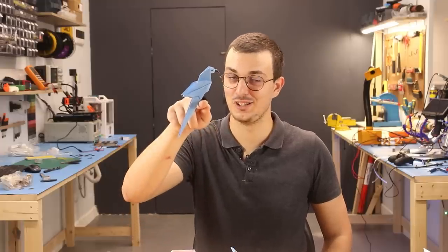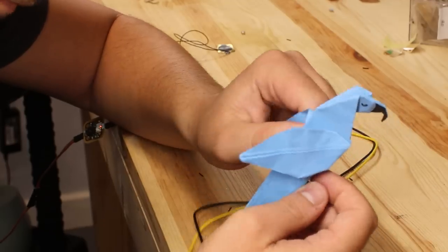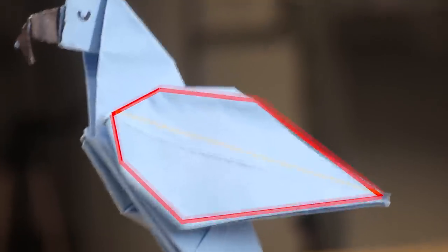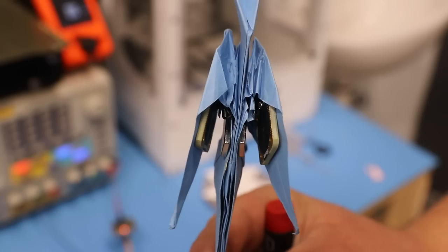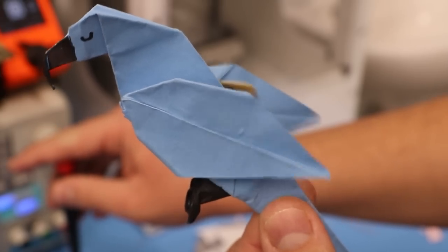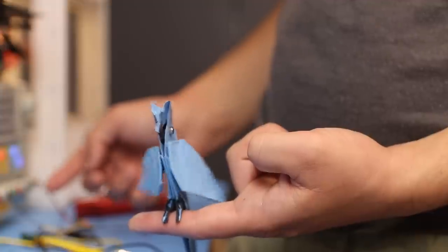The grand finale is this cool little parrot. This is probably the prettiest origami I have ever made, so I felt the obligation to do it justice. I started by putting the flexible coils on the wings and hiding the magnets in the middle. This created a weak movement, because the wings have a very small area and are also folded in the middle. I tried to use larger magnets, but the improvement wasn't that significant, so it made sense to move to the 12-layer coils. The parrot's wings are quite flat, so the new PCB coils didn't really affect them. I also added another flexible coil on the neck so this can also make some small movements. Then I coded in some sounds to make it feel more real.